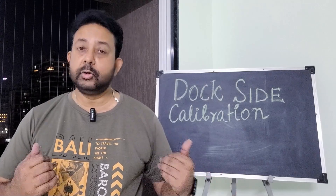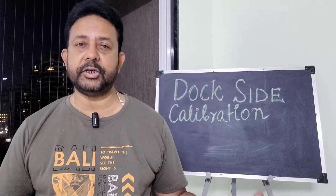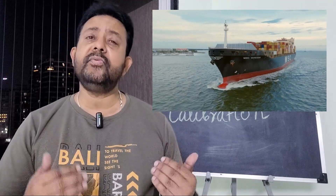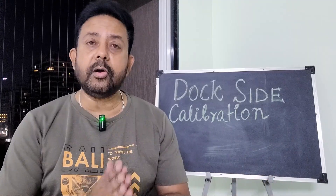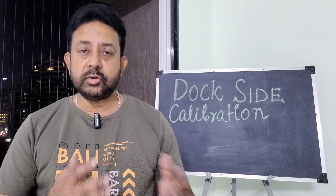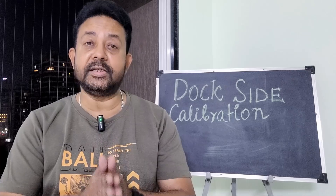Welcome to Offshore Surveying. Today in this video we will discuss and breakdown how we carry out Dockside Calibration for GNSS and Gyrocompass step by step. Dockside calibration is for those vessels which are sailing for a long time and a long distance from one continent to another to carry out some offshore works. Gyrocompasses drift over a long period of time and your new field geodesy and the augmented system may be completely different. So the vessels that want to work there must calibrate their system as per that present position.